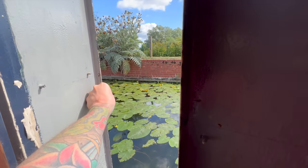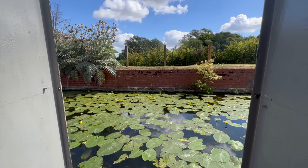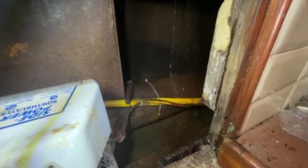Hey, how's it going guys? So today on our smelly little rusty narrowboat, time for an inspection. We finally found that horrible leak in the bow thruster area. Thanks everyone for chipping in and giving advice, but it turned out none of us actually knew. As we started investigating further, what we believed to be the cause of the problem actually wasn't. We found along one of the seams where the metal has been cut away to put the bow thruster in - that's actually where it's letting the water in, or at least most of it.